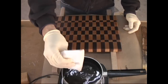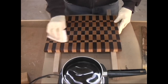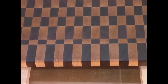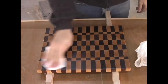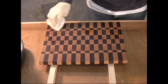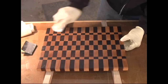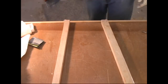I like to use a clean paper towel to spread a liberal coat of the oil-wax mixture on the surface. Be very careful with the oil, just in case it's too hot. After covering the entire surface, I let the board sit for about an hour. At that time, you might notice droplets of oil pooling on the surface — just wipe these away with a clean rag and let the board sit overnight. Day two, I give the board a second coat of the oil-wax mixture and once again let it sit overnight. Finally, on day three, you should have a nice waxy board. I like to remove most of the excess wax with a paper towel and do my final buffing with a clean cotton rag. When it's all said and done, you should have a nicely protected board.